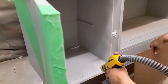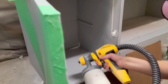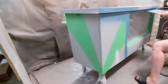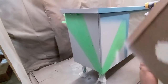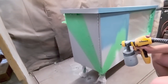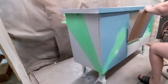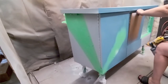I used one of those spare panels to block the inside of the cupboard while spraying. Both open areas I wanted in an off-white color called Crinoline by Country Chic Paint, so I sprayed both open areas in that color, then taped them off so I wouldn't get any blue paint inside. I used that panel again underneath to catch overspray, and then started spraying the beautiful new Country Chic Paint color called Tidepool — a really pretty bright blue — using my Wagner sprayer.